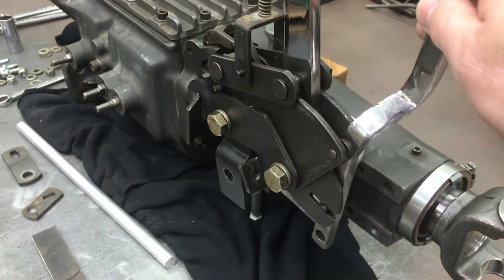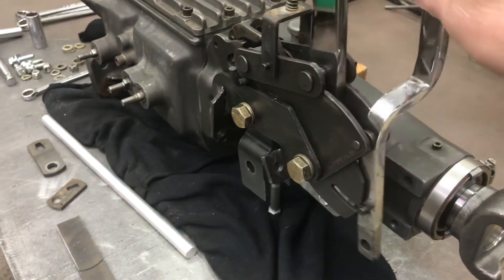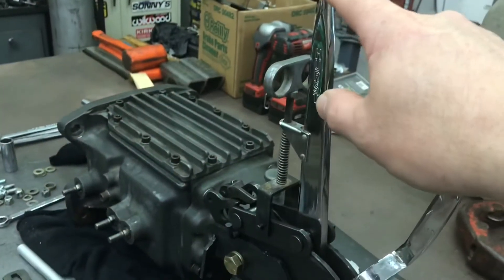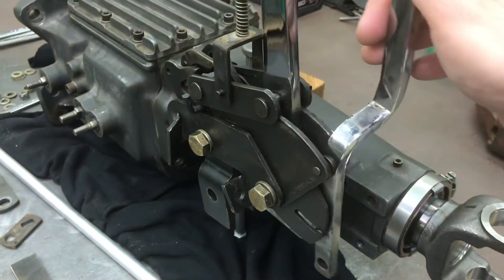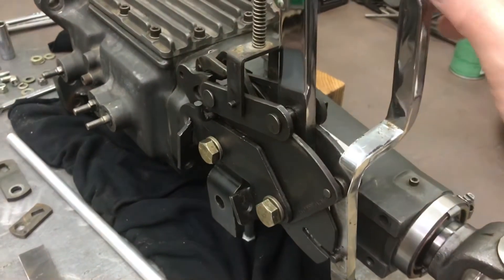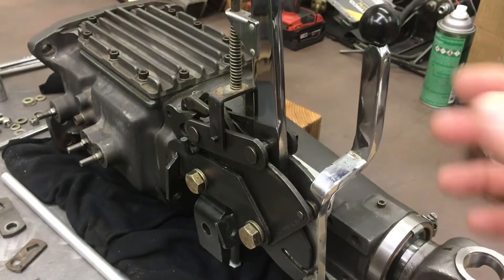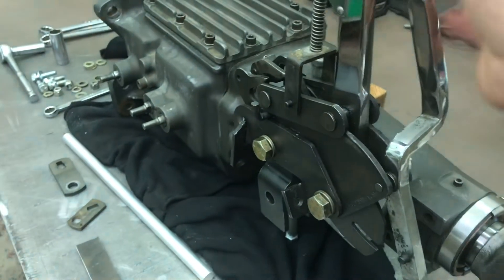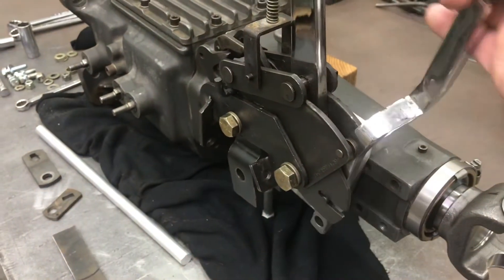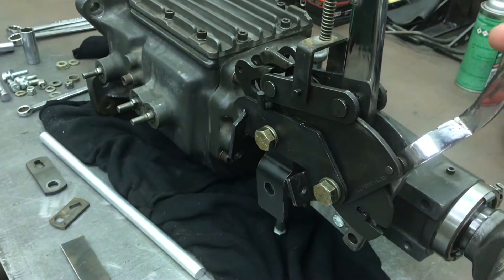When I've done all the other ones, I knock out this pin — I call it the Dilbert pin, and that's a whole funny story by itself. This is locked in neutral right now; when you engage reverse, you can't shift the shifter — it locks it up. The Long vertical gate and all the Mr. Gaskets I did for the Super T10, I push to reverse. I didn't want to build a shifter that's backwards, so I made mine the same way — it's more natural in the car. I like to push to back up. The way the top loader is, it'll actually be working in the intended direction, so I might leave the pin in because I'll be stroking this direction for reverse.